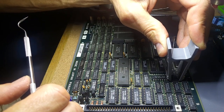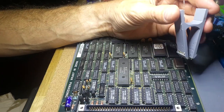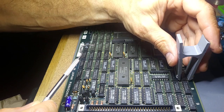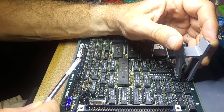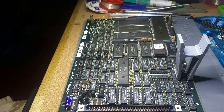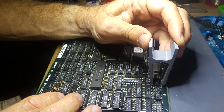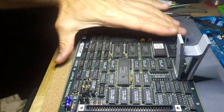One of the pros is that it has very good contact to the IC pins, thanks to quite a large force exerted on the IC and relatively sharp contact pins. It also requires only minimal assembly. This is a fine example of a good design for 3D printing — a single object with no moving parts, exploiting properties of the material to get spring-like action. One bad thing though is the lack of any contact dividers. It's very easy for this clip to fall off the IC pins and short them, which could be catastrophic. So it requires a lot of carefulness when clipping it on.